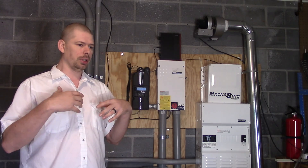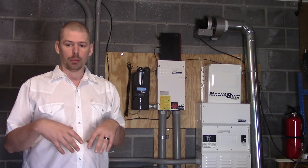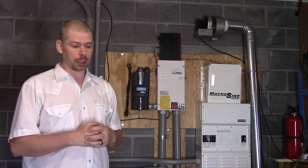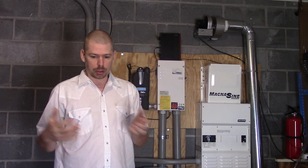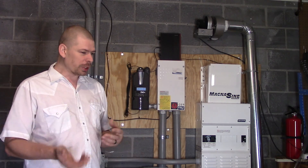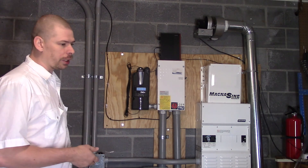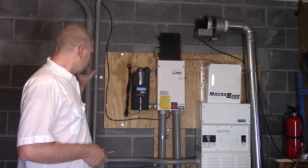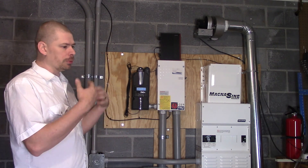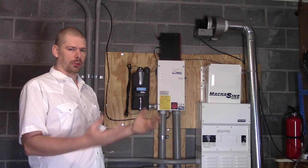We have two fridges, and when we wake up it'd be like 5 kilowatts used. I have reduced that down to about 2 kilowatts, because it is stressful to run on these batteries for a long time — it really kills them. It kills the batteries because I only have a small bank. But if you take the consideration of draining the batteries down, you get more the next day instead of sitting in absorb mode or float mode, where you're not making nearly as much power.